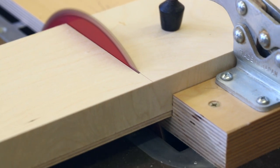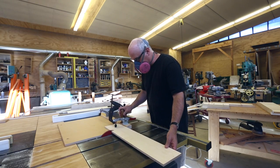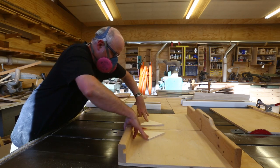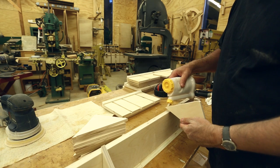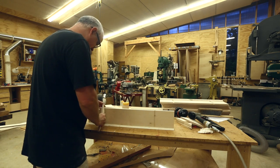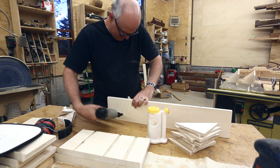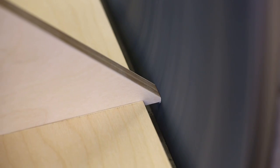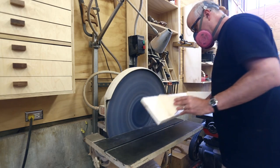Once that's done I can cut the shelves to their final width of 30 inches. Now to make the support pieces that will go under the shelves, I'm going to use some 12mm Baltic birch and just make some triangles. I'll sand a little bit before attaching those. With the dados in place, where the support goes is really easy — I can just stick it in the dado, which makes assembly a lot easier. I used some glue and then nailed them in place from above. I made the triangles a little bit long and then sanded off the extra bit, which fills up the dado on the outer edge of the shelf.